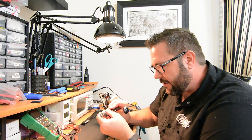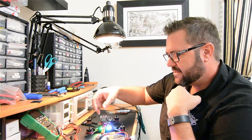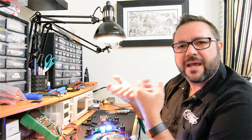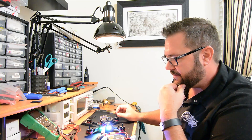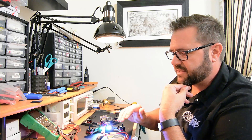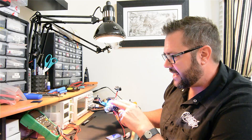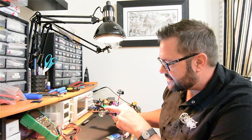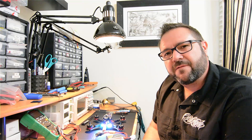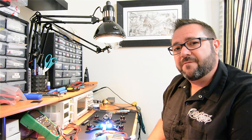We're going to go ahead and fire this puppy up — cross your fingers. It lit up a little bit when we initially fired it up because it's getting some amperage draw through that circuit. As long as it's not on continuously, we're fine. If we fire up the motors you'll see it increase the draw on the battery. So far everything looks great — you can see we've got our bright taillights on. We need to go in and configure some of this stuff now. Use a current limiting circuit to prevent yourself from frying the board when you initially power it up. Let's get back on track and start configuring.